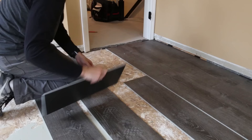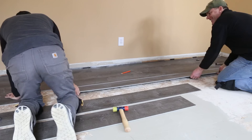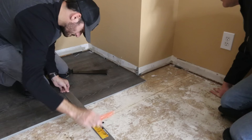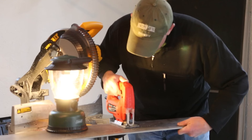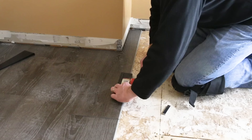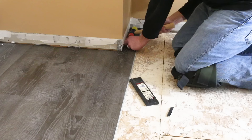We separated the boards row by row until we got to the one with that far corner. We installed a smaller plank at the front of the row, which effectively pushed the rest of the row down and left us with a nearly full-length piece at the end. After cutting that board to length we laid out for the notched corner and Jason cut it out with a jigsaw. As he installs the piece you can see how that small off-cut is now supported by the full length of the board — much better than a small floating piece tied in at the end.